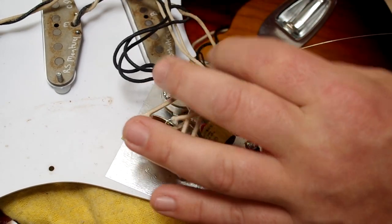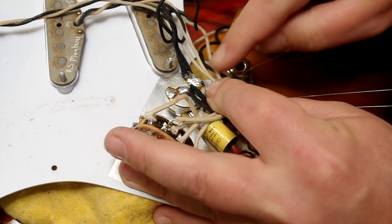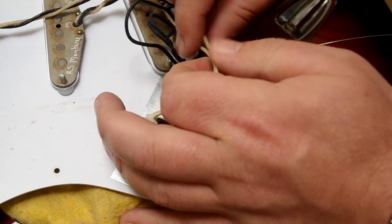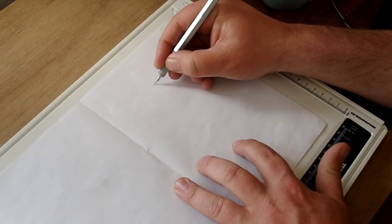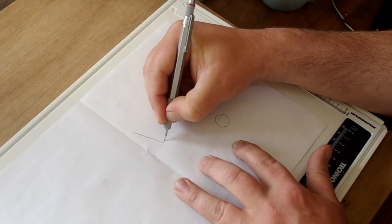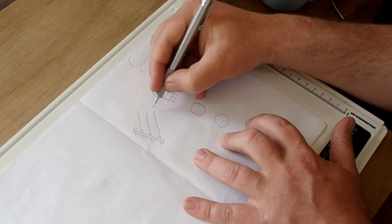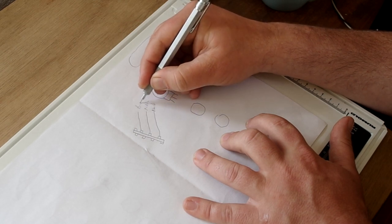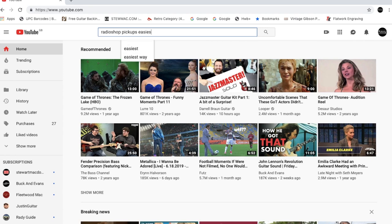The next step is to trace the wires from the pickups and see where they actually go. I've got a blender knob mod in the guitar, and I'm actually going to change things around a little bit. But if you wanted to retain exactly where things went before, it's a really good idea to trace the wires and do a diagram for yourself — even a crude one — just so you can retain that knowledge of where they go and label it. I'm going to convert mine to standard wiring, so it will be a little bit different.